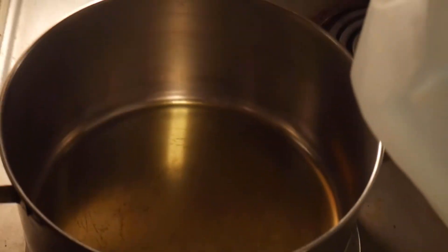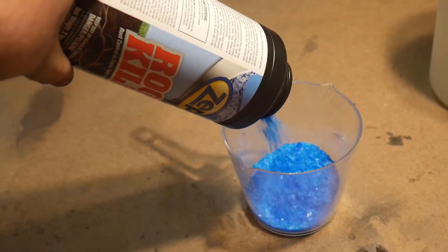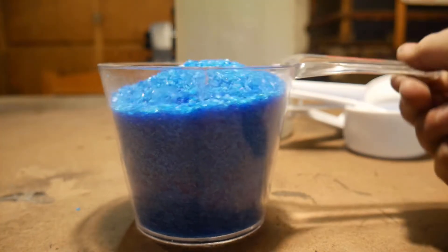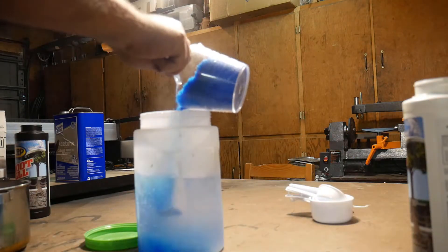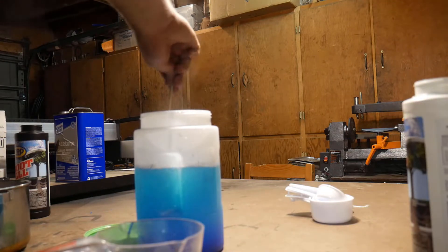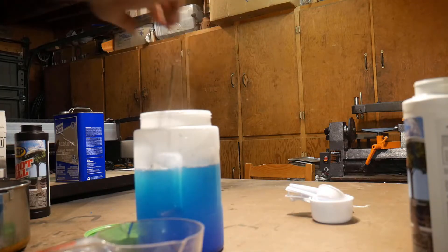Put a little bit more than two quarts of distilled water in a pan and get it pretty hot — not boiling, but pretty close. While that's getting hot, measure out 16 ounces of root kill. The mixture is going to be 16 ounces of root kill and 16 milliliters of sulfuric acid — one ounce of root kill to one milliliter of sulfuric acid. Once the water's hot, pour it into your mixing container and stir thoroughly outside or in a well-ventilated area. I recommend picking up a plastic stirring spoon at the dollar store, and probably throw that spoon away afterwards.